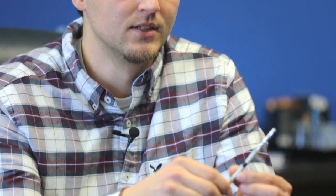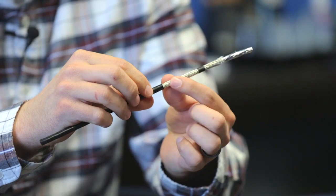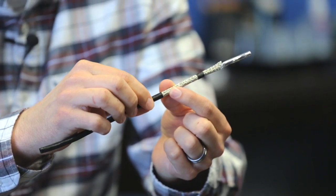From an electrical standpoint, the reason why a foil and a braid is the most effective is because a foil is good against high frequency noise and a braid is good against low frequency noise. The combination of the two covers all of your bases and really protects that cable the best against interference.